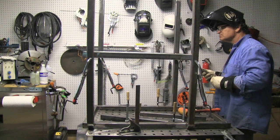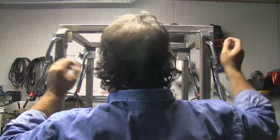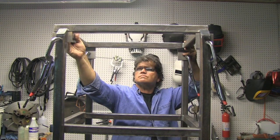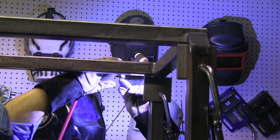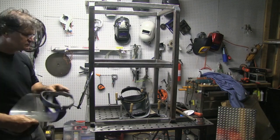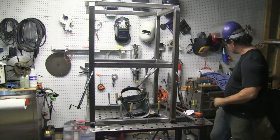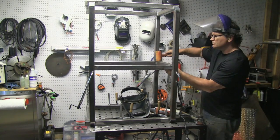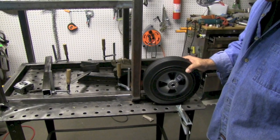I'm doing the same thing up top, except I'm using little plates because of the taper on the end. I'll get them lined up just like the one below and get some tacks on with the scratch start. Then I discovered I'm a little tight on room for the welder I intend to put in there, so I'm going to drop the shelf an inch — just clamped all the clamps an inch lower, cut the tacks, bumped it down. No sweat.